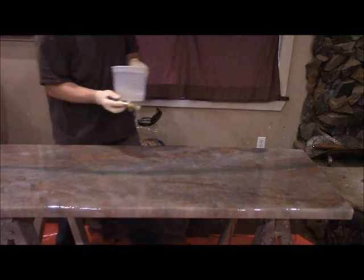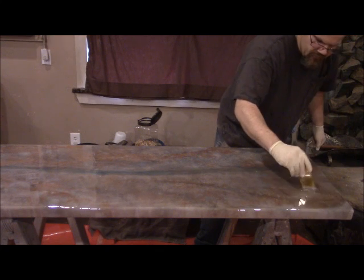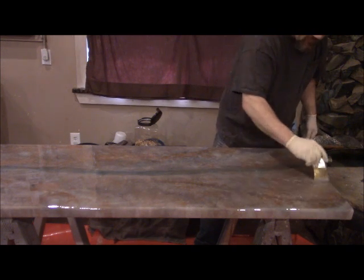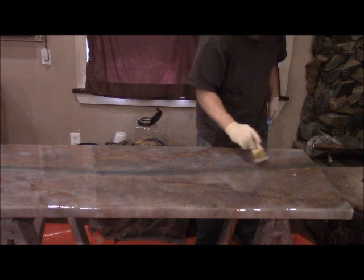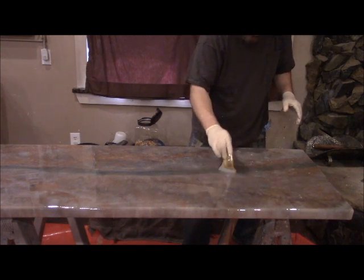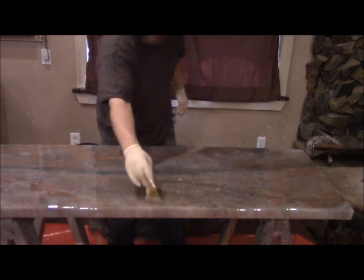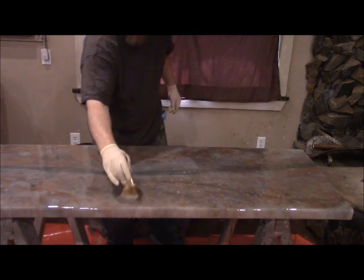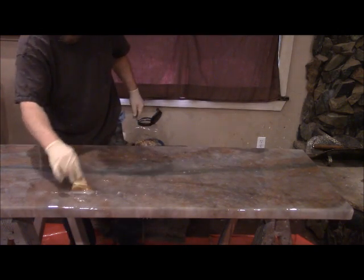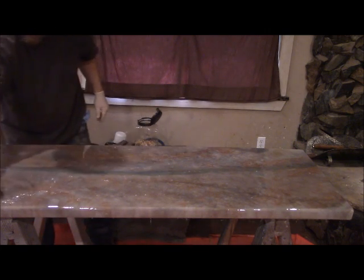I got the front edges brushed. Now I'm going to chop the material — I'll prime the brush with a little bit of material and start chopping. I'm not pushing hard because you don't want to pick material up without putting it back down. The only purpose of chopping is to create a random pattern that gets rid of any iridescent look from the trowel. This also helps mix the material again — so this is our third time mixing. This system will prevent you from getting a top that doesn't cure properly.